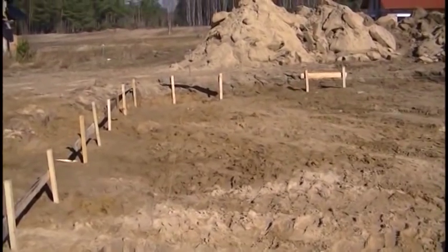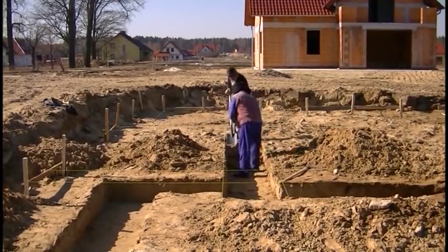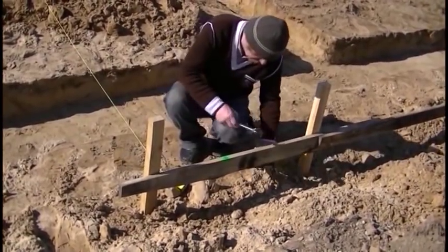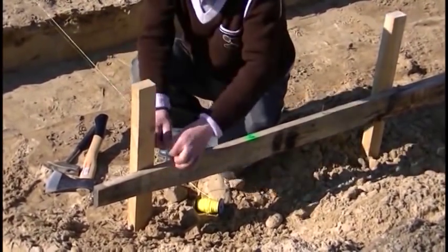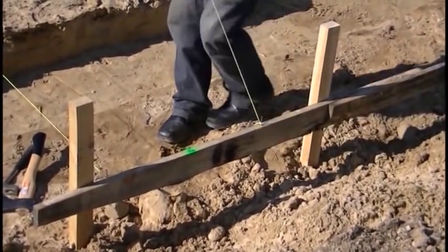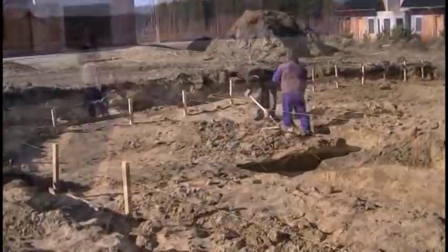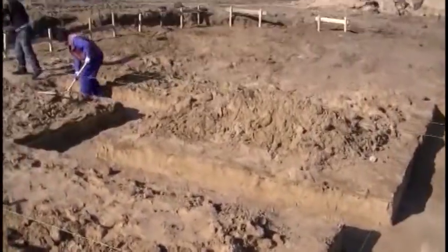The frozen soil causes a slight delay, as we have to use a pickaxe and work harder with a spade. However, the advantages are considerable: firstly the ground is dry, and secondly the edges of the pit don't sink, which also influences the quality of works. As mentioned earlier, we have quite a lot of profile boards. We will make four isolated footings in the foundation on which load-bearing columns will be placed to shift the weight of the ceiling and the arch-shaped lintels. So I will be able to discuss here many interesting constructions made of reinforced concrete — the entire project is quite useful for instructional purposes. But let's go back to ground works.